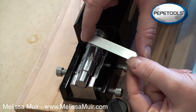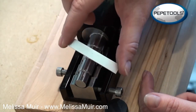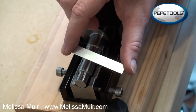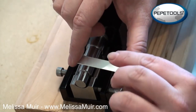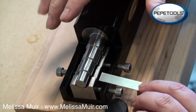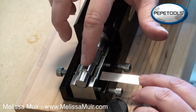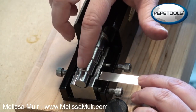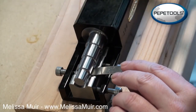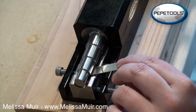As we're going to be making a spinner ring, I start off with a wider stock. Typically I will anneal my metal, but I wanted to show you that you can still do this without annealing your metal. You just have to account for some of that spring back that is going to happen. So I really want my ring to be the size of this third mandrel, or at least close to it, about a 6.5 or so. But I'm actually going to start on the 2 smaller dies, and then again, like I said, we're going to have some of that spring back where the ring metal wants to open back up. So I'm going to just come in on this second die